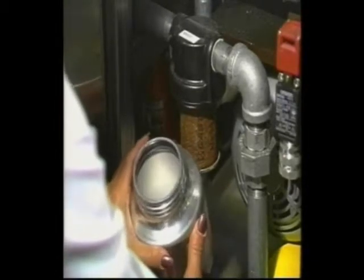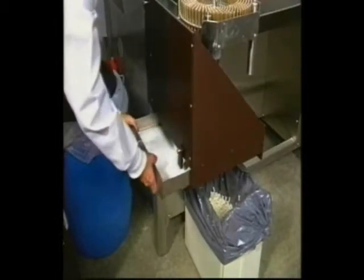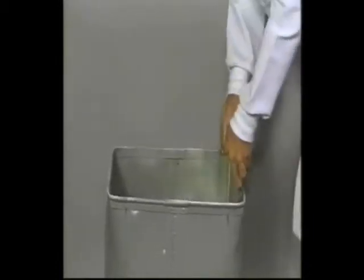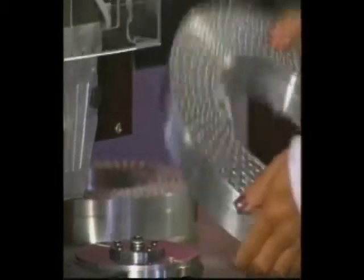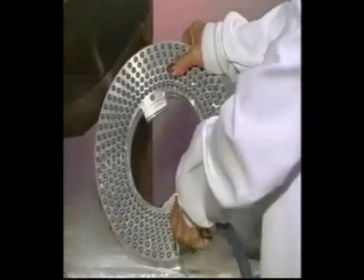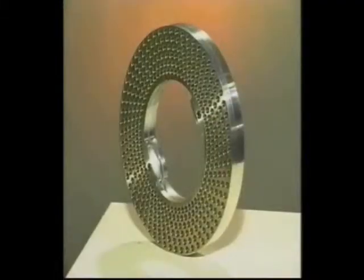Because you will be constantly dumping bad capsules and powder into your skag drawer, you will need to clean it regularly, especially between filling different products, as it can contaminate your workspace with residual product. You want to keep your filling ring clean at all times to eliminate any burrs forming on the aluminum. The most common method of getting powder out of your ring is to use compressed air. Do not bang your rings together — repairing or replacing a damaged ring is costly.